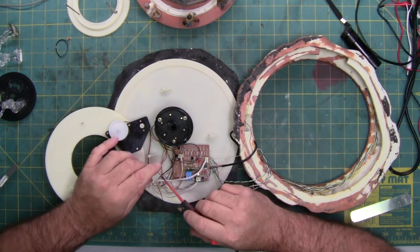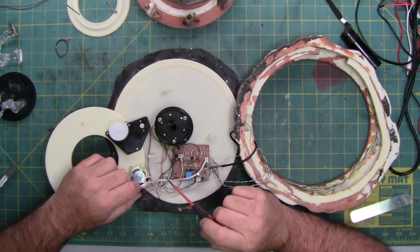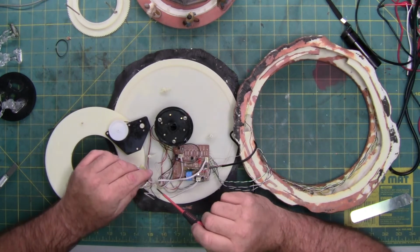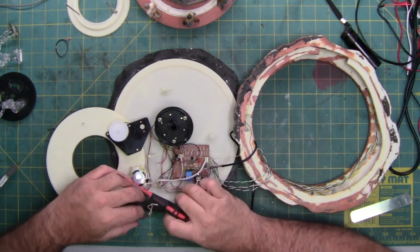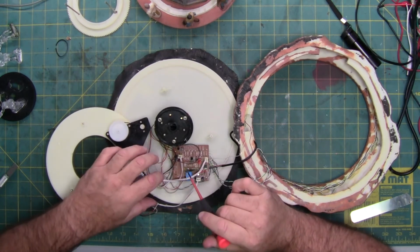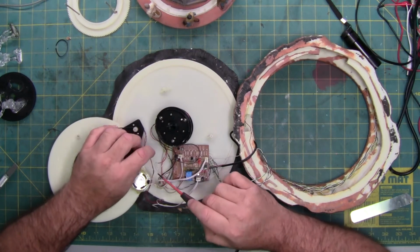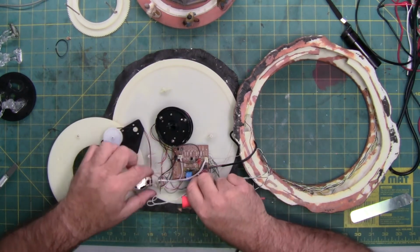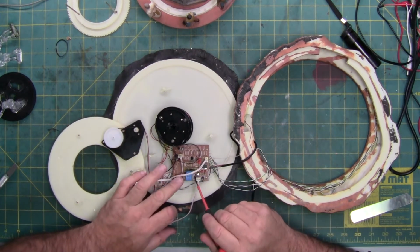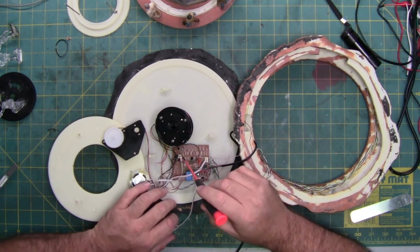We got the typical cheesy Lemax solder wires where they soldered it and they're just bare connections. That's pretty common. They usually put a dab of glue on them and then glue them down so they don't arc, but when that glue chips off, that's it. Let's see, this is the drive motor down here next to this big relay for the big ring.